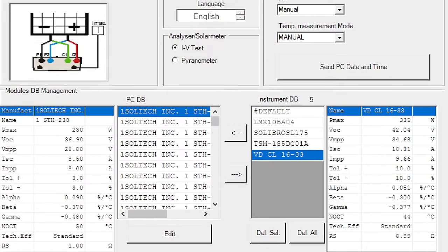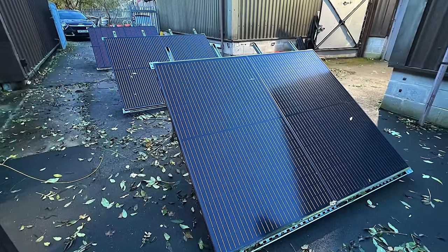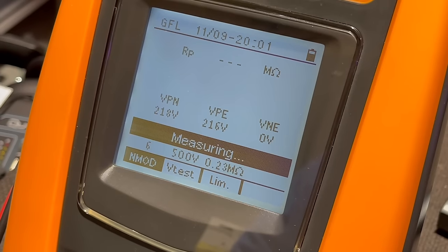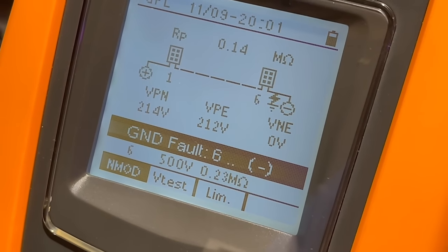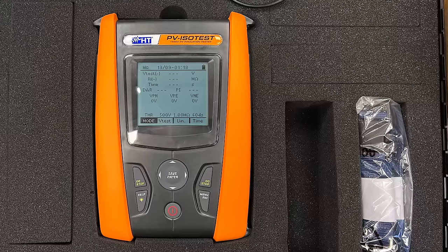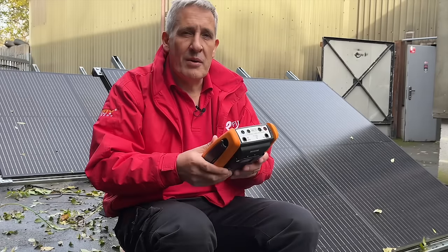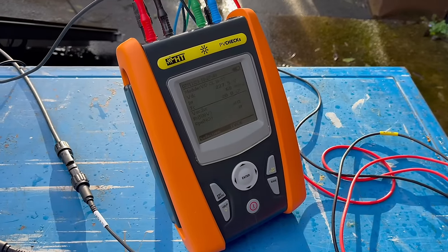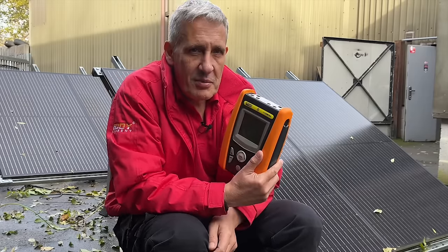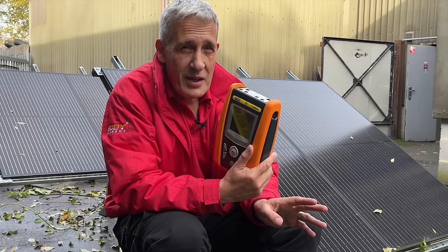You can also perform standalone tests for continuity and insulation, which are useful for fault finding and initial setups of installations. I noticed during this review that the results for the insulation test were not stable and in some tests fell under the one megaohm pass limit — clearly not something we can live with. Faults like this can be a challenge to track down, so in the linked video on screen I'll show you how you can find a needle in a haystack with this PV ISO test unit. I've also left a link in the description for more information about the PV Check tester used in this video. If you've got any questions, please let me know in the comments and hopefully we can answer them in a future video — where hopefully for once it's not raining.